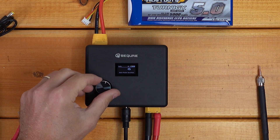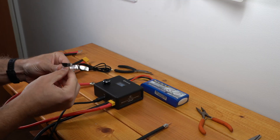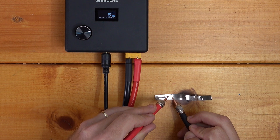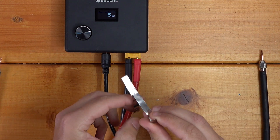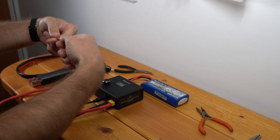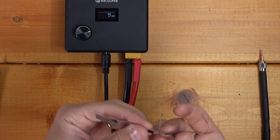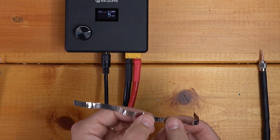Let's try turning it down a bit — maybe 10 was a little high. I guess I should really start at what they set it at by default. Let's try that again. So I'm able to get that apart with my hands, but still, we've actually ripped the nickel strip apart to get it apart. We've got a hole in it now, so that is quite a good weld. I am really satisfied with that.